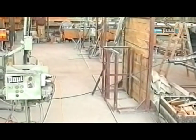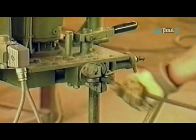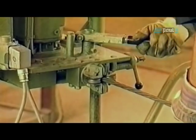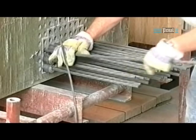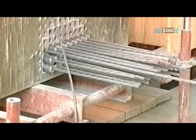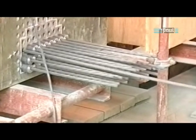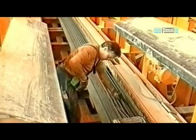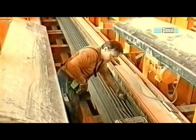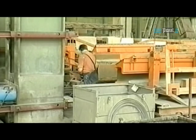The strand is unwound from the coil and pushed into the mould with the help of an electrical strand pushing machine. The feed rate is controlled via push buttons, with a choice of two feed rates. The work is more operator-friendly and easier with radio control, allowing the operator to guide the strands and control the feed rate personally.